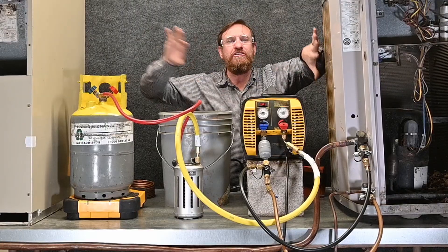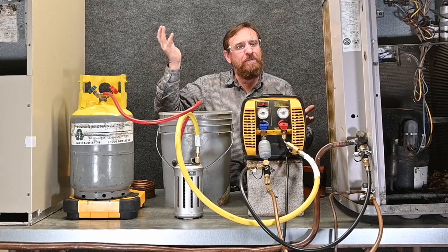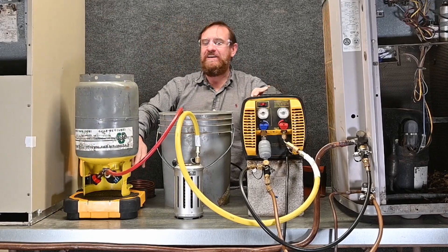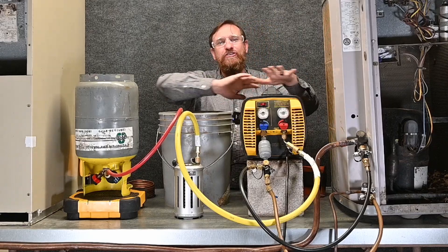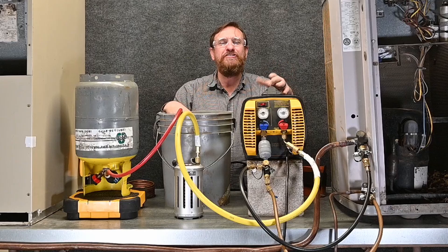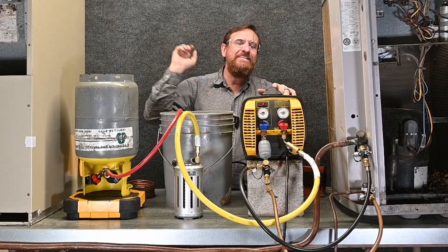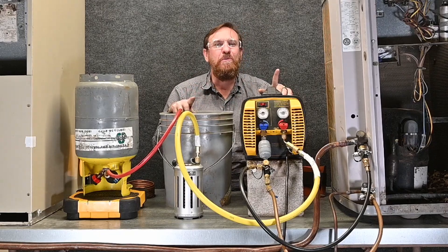To summarize: keep the temperature of our system as high as possible for as long as possible; keep the temperature of refrigerant going into our tank as low as possible to reduce compression ratio and make the pump more efficient. Use the largest, shortest hoses possible on the high side, ensure we're taking liquid form, go in as liquid through the vapor side, do away with Schrader cores and the manifold gauge set, and use two large hoses straight to the input. We've reduced all restrictions and compression ratio, dropping recovery time significantly — probably from seven minutes to around five minutes. Nobody likes doing recovery, but knowing these tricks saves you time and money while doing the job the right, legal way.